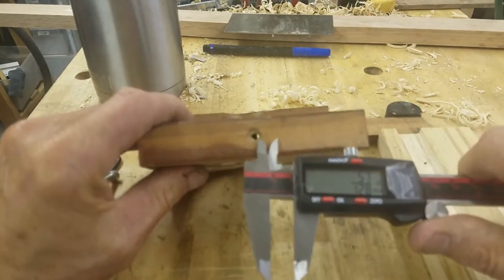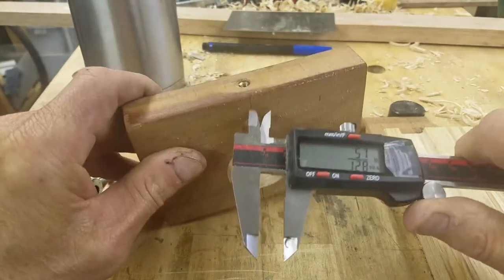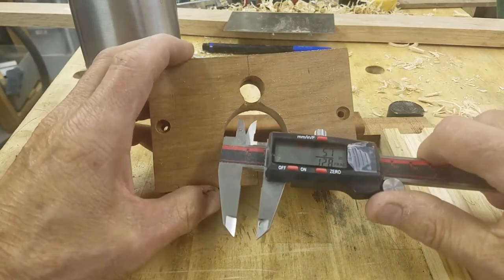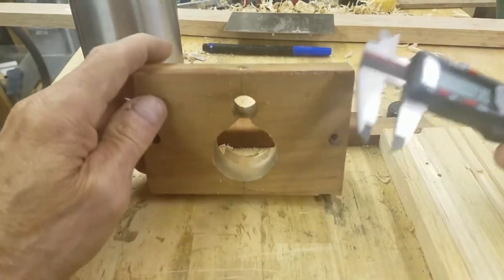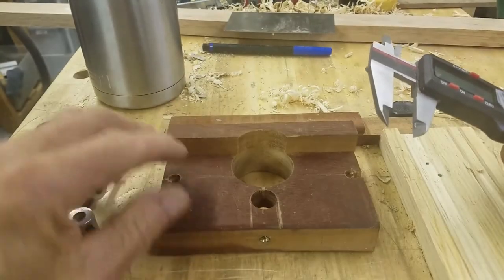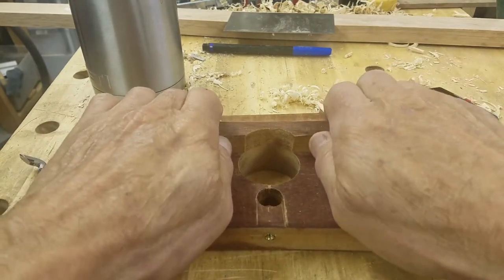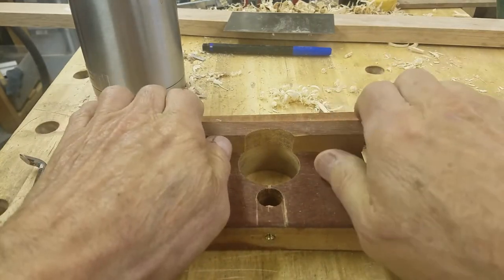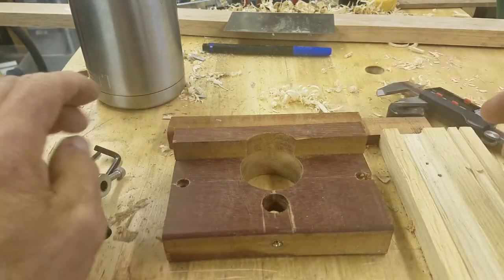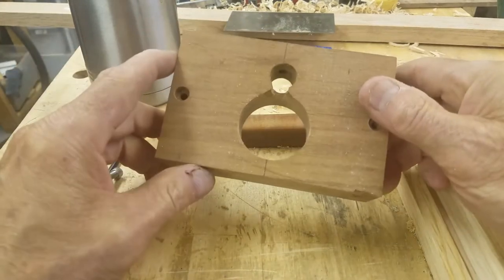On the side here, I've got a 10-24 insert that's used to hold this collar in. There's a relief cut down here where the cylinder goes through this hole. These two holes were fails for holders. I actually ended up just putting this block up here because I found that I like to push my thumbs up against this and push the plane back and forth. So that's essentially the base frame, pretty simple.